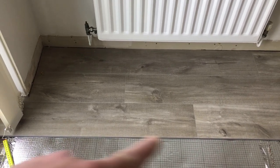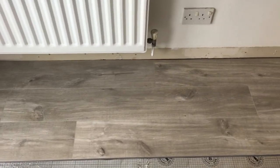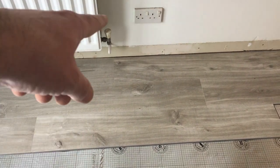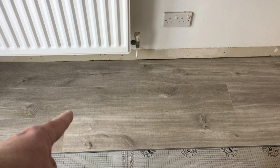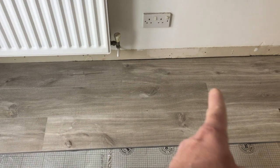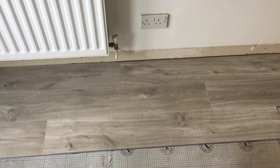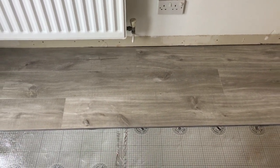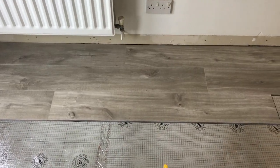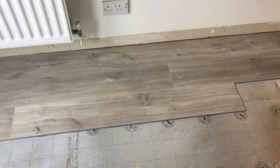The important thing for me is not to line up any of the joints - I always stagger the joints throughout the whole floor. I don't have them perpendicular either - I wouldn't have a joint there and a joint here. Just stagger them all over the place. I always try to do a whole floor so that no single joint, if you look right along the floor, meets. This gives you a more staggered effect.